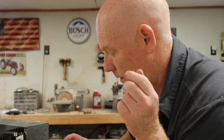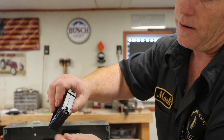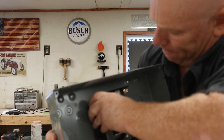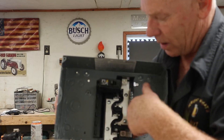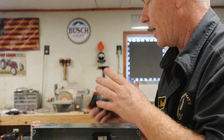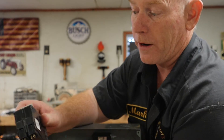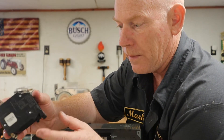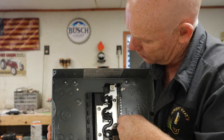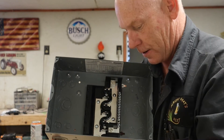To run a 240 circuit, you need a 240 breaker. A 120 breaker has a hook and an electrical connection — it clips onto that clip and snaps into place, you hook your wiring up, ground it, flip the breaker on, and you've got voltage going out on a standard 120 circuit. To make that heater work, you've got to have a two-pole breaker — this will send 240 volts out. It's a two-pole breaker, so it's going to have two tabs on the bottom that connect into your bus bar, picking up power from both bus bars.